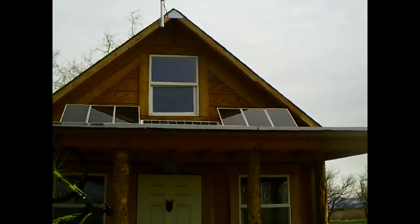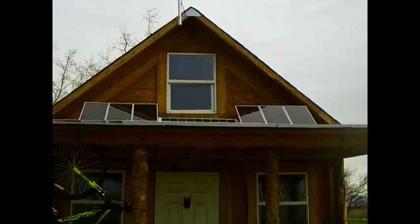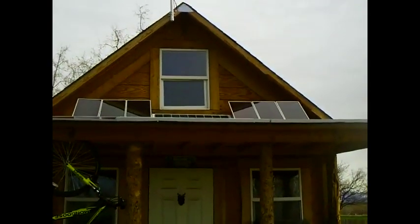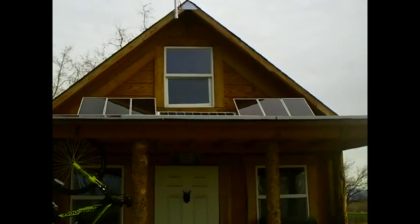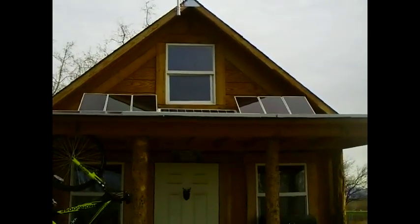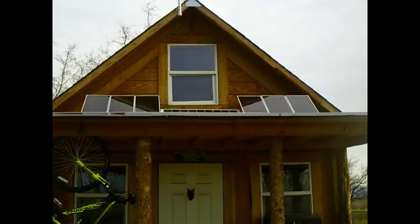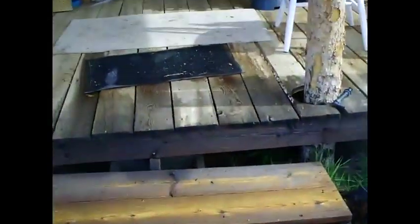Back down off my roof. Most people mount solar panels on the roof, but if your roof doesn't face south or doesn't get good sunlight, that's not the best place. In that case you can mount panels on the ground using a rack system, or on a pole — called a pole mount system. They also have highly technical poles that track the sun as it crosses the sky, called a tracking system, though that's more expensive. Most people use a permanent mount on the roof, ground, or pole. Talk to the guys at Northern Arizona Wind and Sun for guidance.